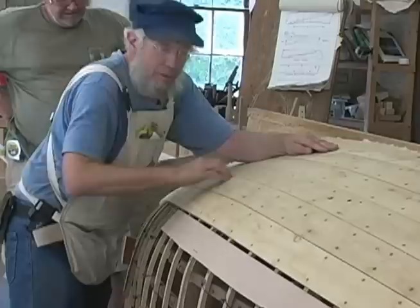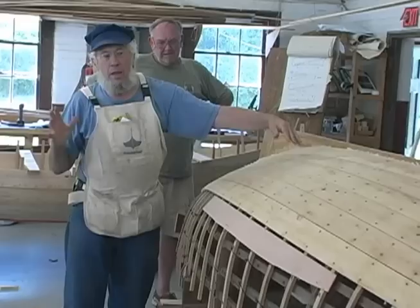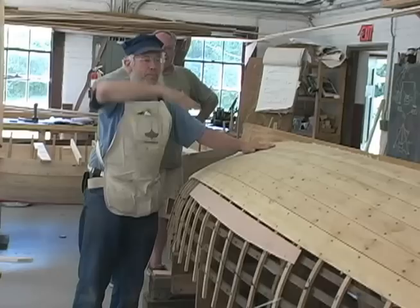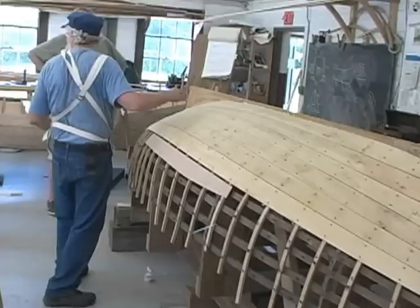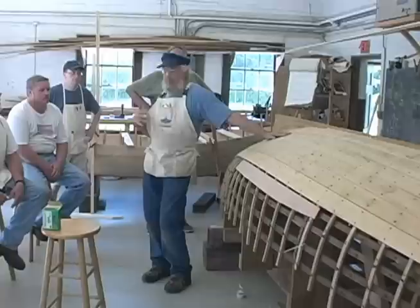So this plank is going to get bigger and bigger, more curvy like this, more banana-like. Then somewhere in here, you're going to get a plank that's S-shaped, where it's still trying to get this part of the banana, but then it's going to try to pick up the curve of the sheer. And then the rest of the planks are going to be curving the other way. So there's no real straight plank anywhere on this. You have to build the spiling bat specifically for your planks.